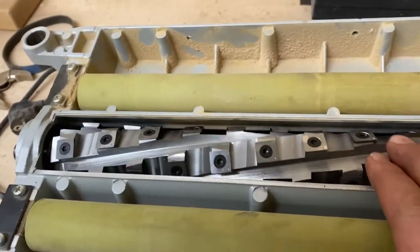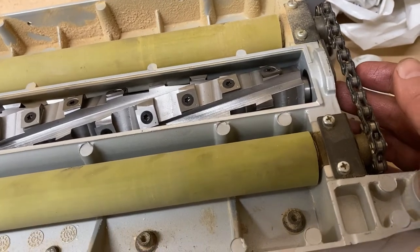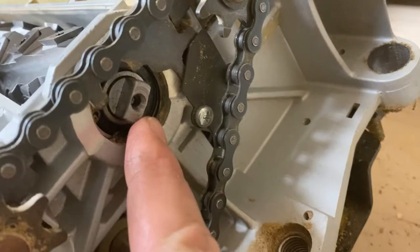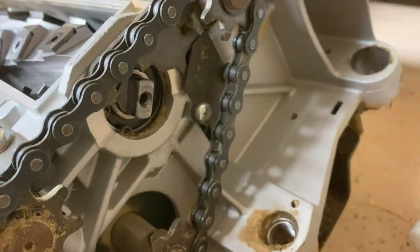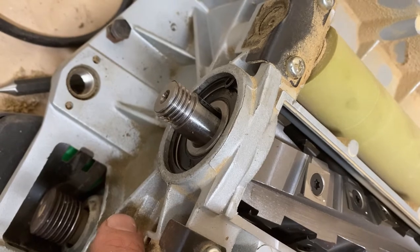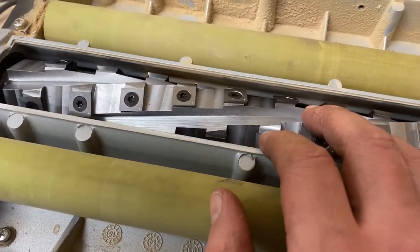Okay, so the new cutter head is installed. Actually, not any difficult at all. Bearings, small bearing, just make sure you get it started correctly, because it's not a full shaft till the end. It can be a little bit tricky to get it going, but it taps nicely in. It's got a good fit and no problem. Same with the larger one, but this is easier to get started. Just tap them on, seg ring back. Cutter head installed, took a wee bit of time to install all the carbides, but nothing major.